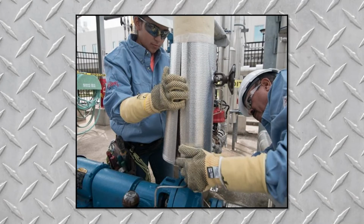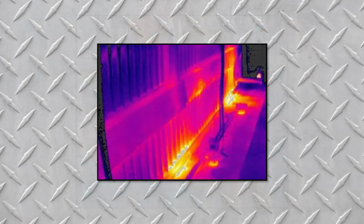But where? Every place you're heating with process heating, you're trying to separate the process heat from the environment around it. Most insulation systems are going to reduce unwanted heat transfer by usually around 90%. We look for any bare surface and argue that insulation is mandatory. Now, thermal imaging cameras are becoming fairly inexpensive, and they can provide you with a temperature on the surfaces of piping or an oven, and will show you right where the maintenance problems are.